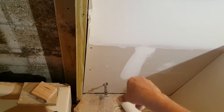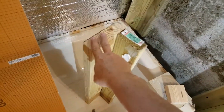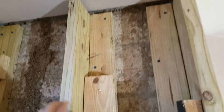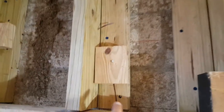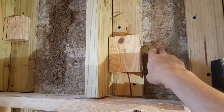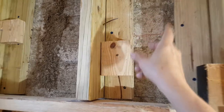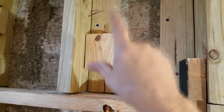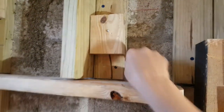Here are our studs for the build-out. I pre-built a few of these by taking a two-by-six and fastening it to a two-by-four with my nail gun, shooting through all the way down the line - now it's pretty solid. I attach them right to the wall using blue Tapcon anchors. The way you do this is you drill the holes through the wood and through the cement block using a hammer drill with a masonry bit - you can't just use a regular drill bit. A hammer drill, especially my new DeWalt, with a concrete bit takes only three or four seconds to go right through.